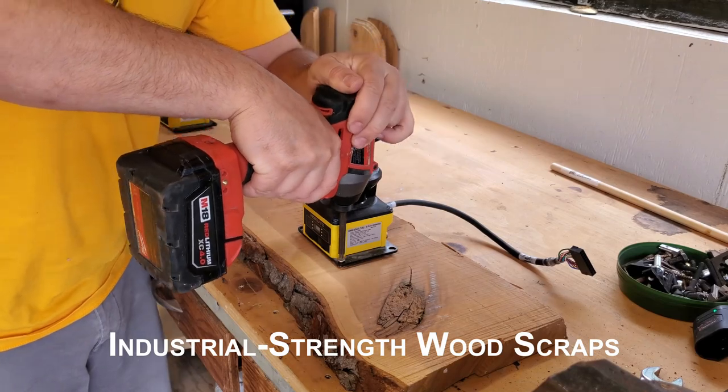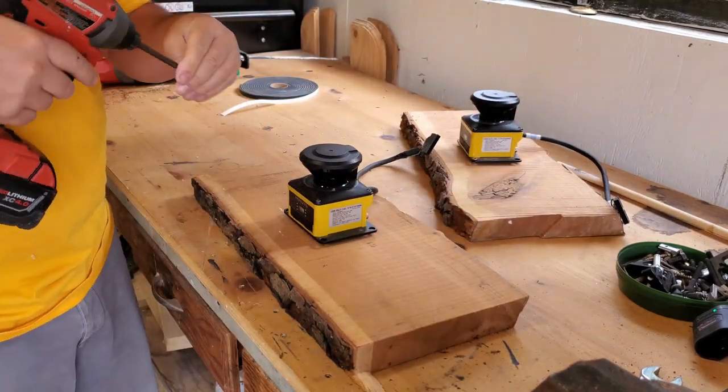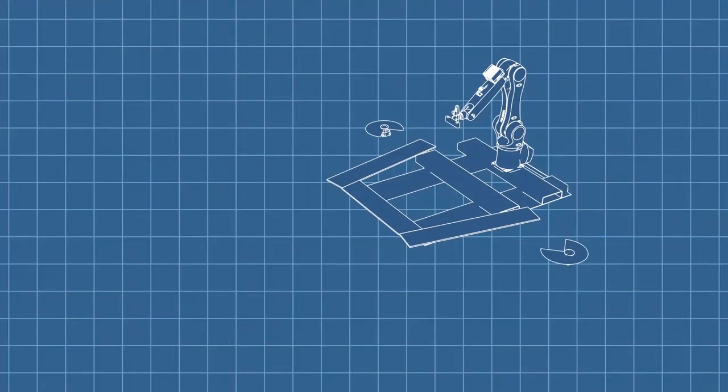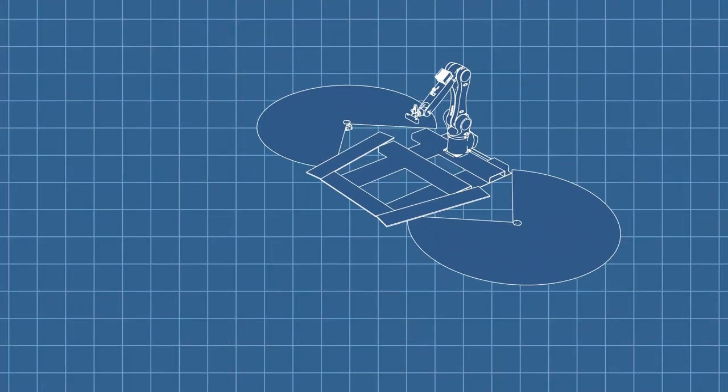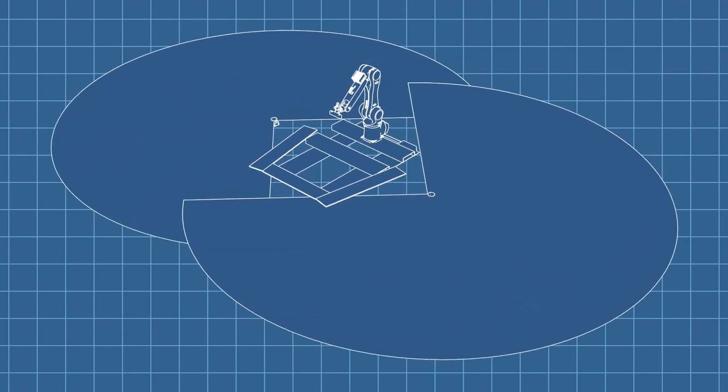This system has an industrial robot arm, which we need to make safe. It also has fire and explosives, and is probably going to be around drunk people. So safety is something we definitely need to add. For that, these safety lidars from Hokuyo. These things we can set up on little platforms that you can move around once they're actually set up on site, so that it will cover the whole area around the robot. If the robot's too close to anything, it won't work. Or if anyone comes too close to it while it's running, it'll immediately stop.